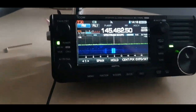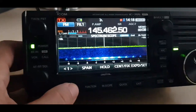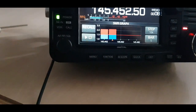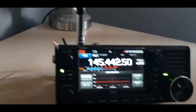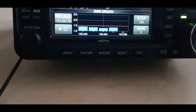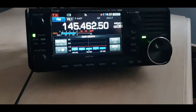let's get off that frequency. Not too bad. We could even try the SWR thing. So there you go. It's 2. So I'm going to move it up a bit. See if it gets worse or better. So we moved it up a bit, the bottom part as before. And we're going to give it a test. Look, we're 1 to 1.5 and lower. So I could adjust to get a better SWR, but to me that's completely acceptable. So let's try and do a call out.